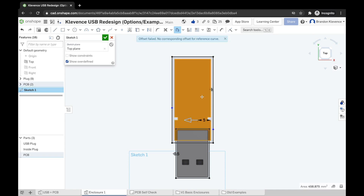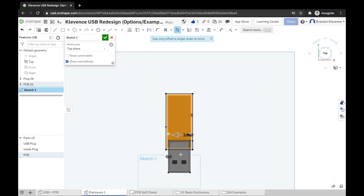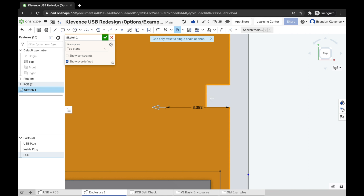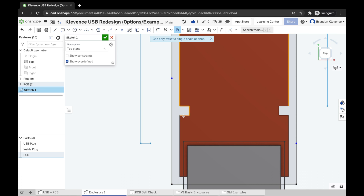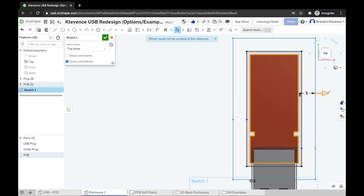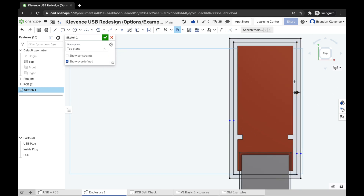For our last offset right now, I'm going to offset the outer lines of this shape, going all the way around to get the full chain selected. Once I have that full chain, I want to offset it a second time to 2mm. I hit Enter and type in two. Now I essentially have an air gap and a future wall that we're going to extrude.